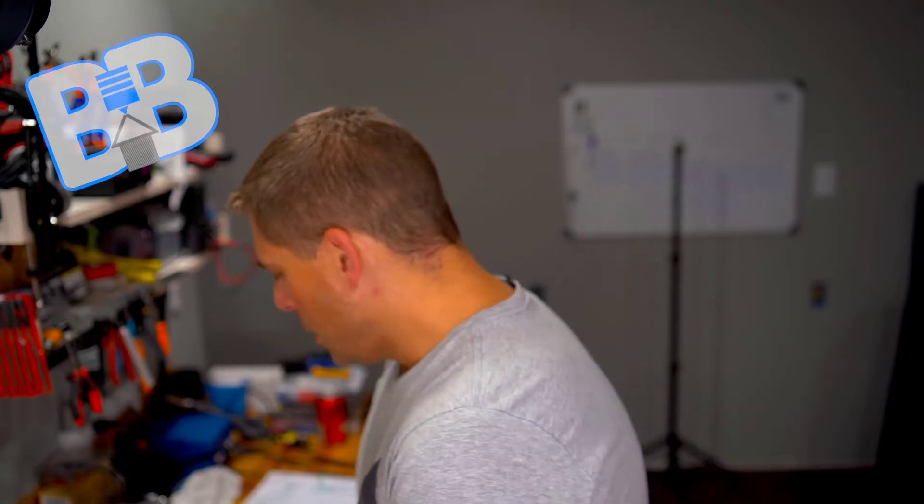There's a good thing to that. First, I have no doubt this plastic is truly ABS, which is great for the price. Second, that goo is a usable concoction. If you're having trouble printing with ABS, mix about 75% ABS snippets or pieces with 25 to 30% acetone in a container that's safe for acetone — obviously not made of ABS. It will dissolve and make a slurry. Apply that slurry to your build plate, the acetone evaporates, and you basically have an ABS glue to stick your ABS prints to. ABS sticks pretty well to itself.